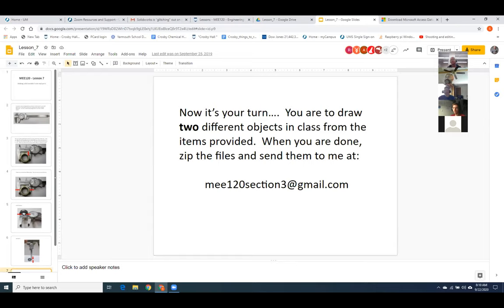I have a question. Yep, shoot, Gage. So how are we going to take angles if something is slightly angled? Like, assume I went and measured this cup. This cup angles outwards. So there's two ways you can do that. That's a really good example. If you measure the diameter at the bottom, the diameter at the top, and do a little trig, you could get the angle that way. All right, so I could work from two profiles. Yeah.